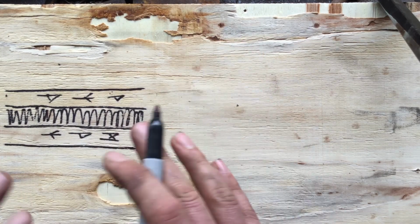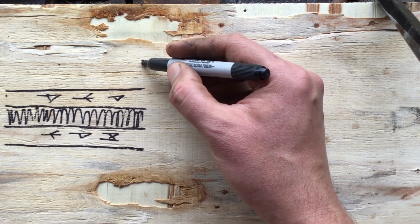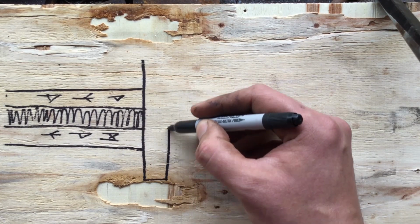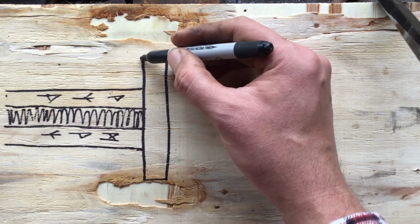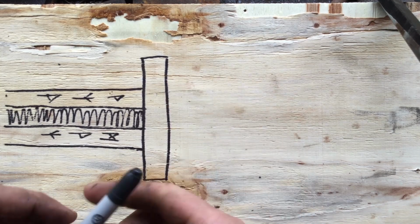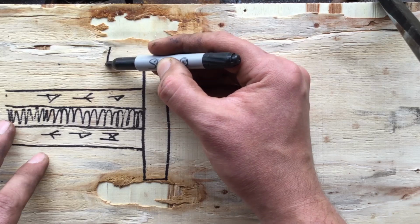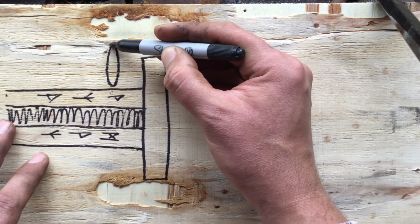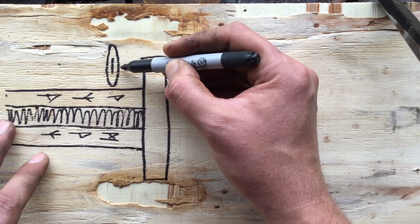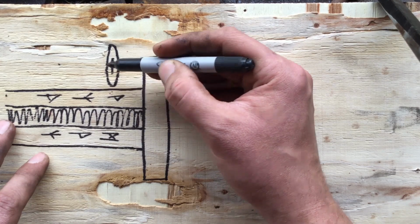Now, Viking swords have an upper guard and a lower guard. The upper guard, which is the largest one, is kind of from the side, kind of rectangular in profile, maybe about that big, so that when you sit your hand there, it completely covers your hand. From a top-down perspective, though, it's actually going to be kind of ovular, I guess. The sword blade will be here, and the thickest point will be across here, and it'll swoop down into a round, and then into a round there and there.